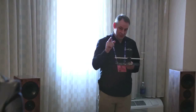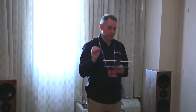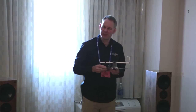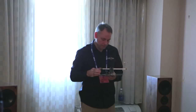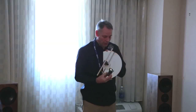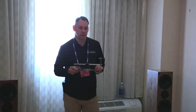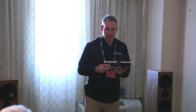So what we're going to hear now, again, is the same arm, same cartridge, but set up with a different curve, a different set of geometry. So Lofgren, Baerwald, all dates from 37, is it? 37. So basically, we've been using the same mathematics to set cartridge relative to record since 1937. These guys have done the first new geometrical calculations that we're aware of. And they term their curve Unidin. As in the DIN standard from Europe.